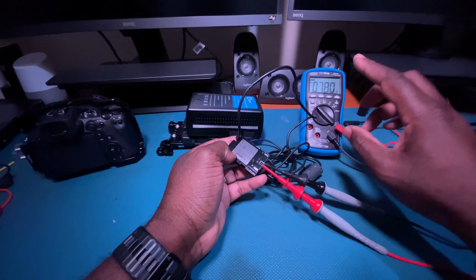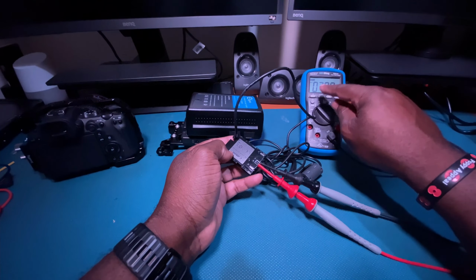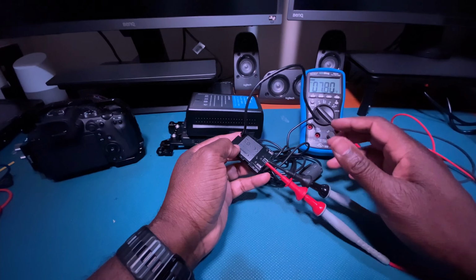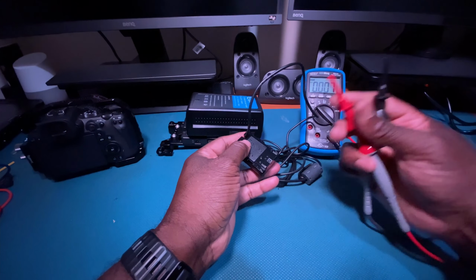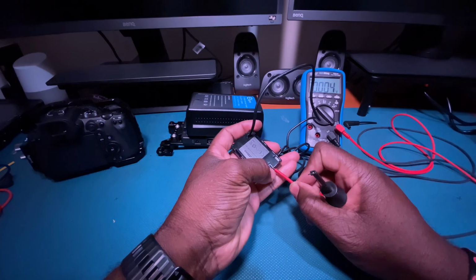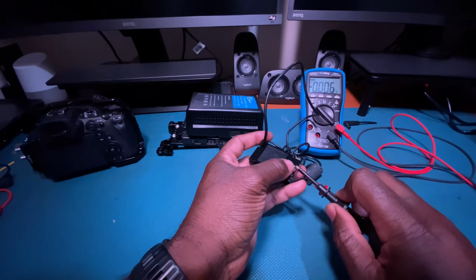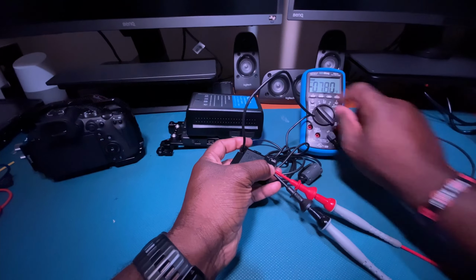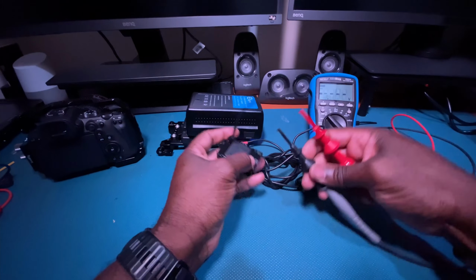The important thing is it looks like I've got the polarity correct as well, because if I hadn't, towards the left hand side of the 0 here, you'd see a negative sign, which indicates that the polarity is incorrect. So just to demonstrate what I mean, let's swap these round. Make that in there and hopefully get this in here. Can you now see the minus 7.80? So I have got the polarities right.